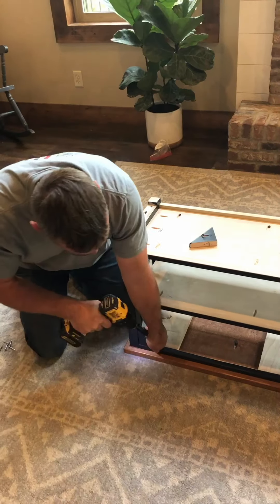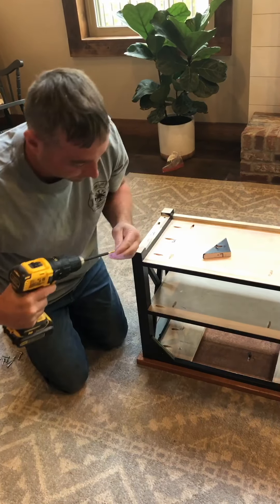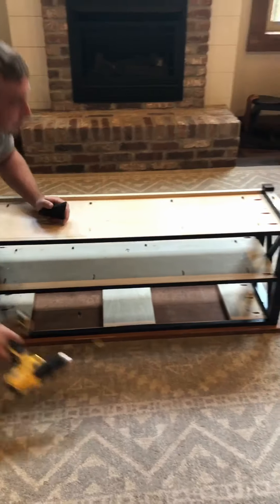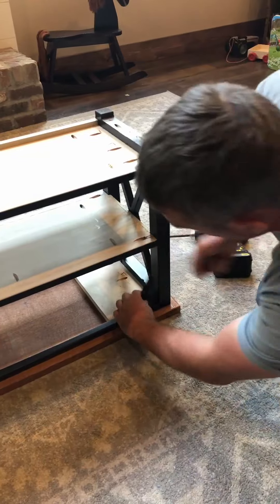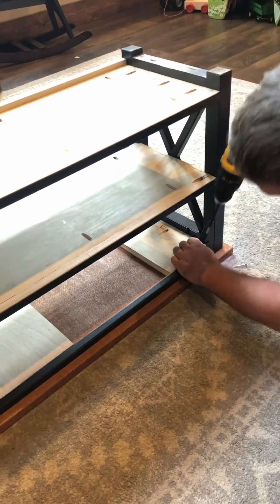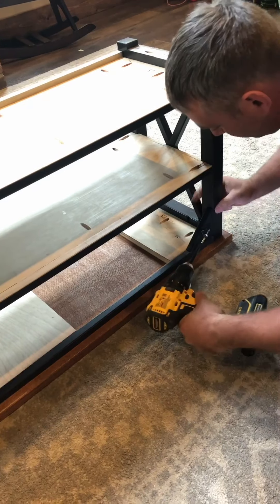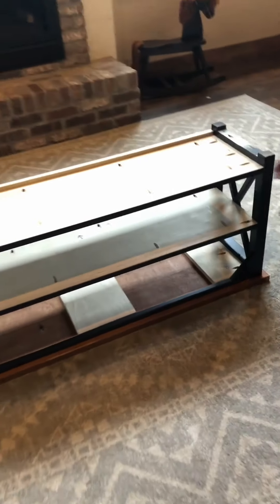Come up to the top and make sure it's on the marks. On these screws, don't tighten them all the way down — if you're going to get your bottom floor piece in, just tighten them almost all the way down but not quite. Next, grab your bottom floor piece. You'll have a taller edge along the front that goes towards you. If you can't get it to slide in, it just means you need to loosen the shelf up just a little more. Once you can get it, it should slide right in there.